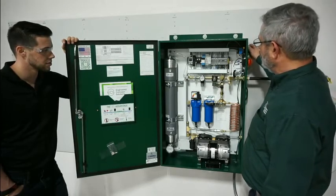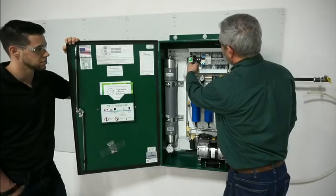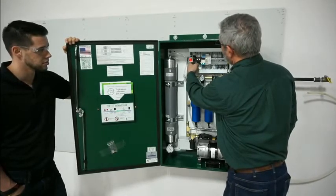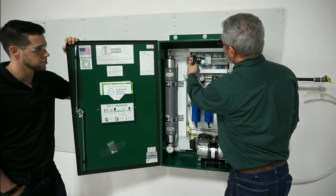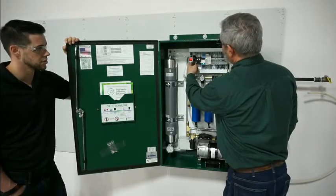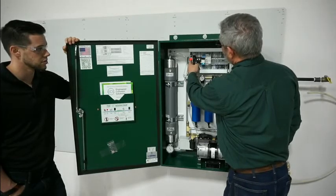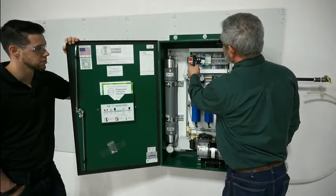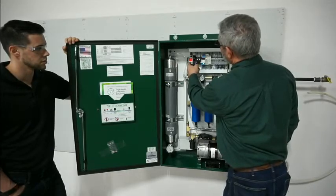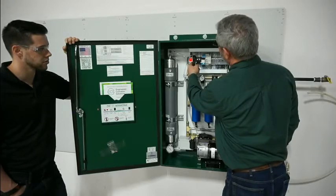What we'll do is turn it on and push the lower right-hand button and hold it until the display set comes up. First thing that comes up is SP, which is your cut-out. We're going to move to the RP and adjust it. Once we get to it, we press the center button — it's going to start flashing — and then we raise or lower that number to where we need it to be. We want it to be at 25 PSI.